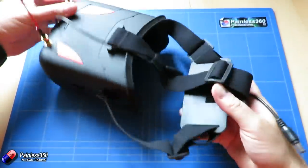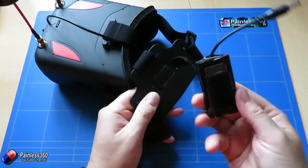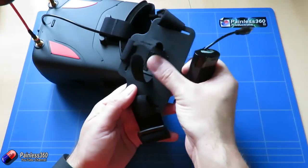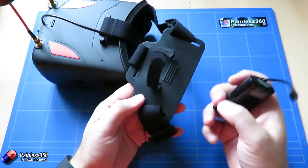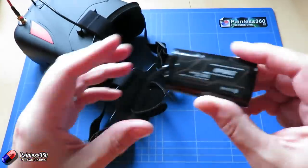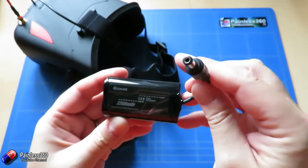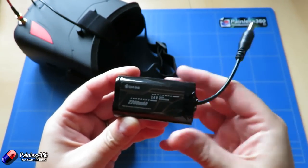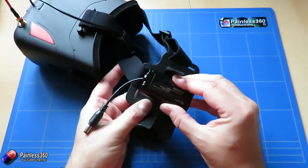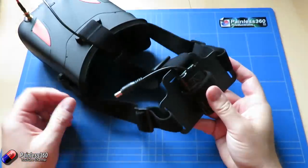The battery itself comes as part of the kit — it sits at the back. I've added some velcro onto both the battery and the strap, because unfortunately without velcro the supplied strap means the battery just wants to fall out all the time. It is a 2200 milliamp, two-cell LiPo with the standard 6mm barrel connector you get on lots of other goggles including Fat Sharks, and it works really nicely.